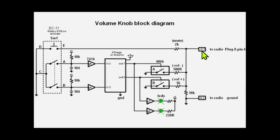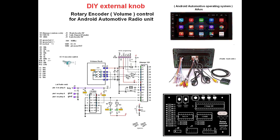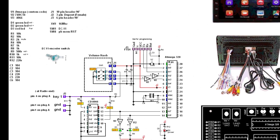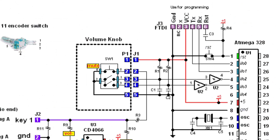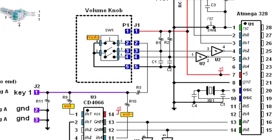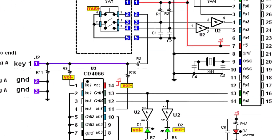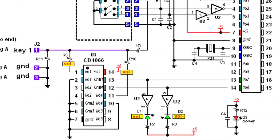The resistors would be the equivalent of the volume plus or minus on the steering wheel buttons. In the schematic diagram, switch 1 is wired to the buffer U2 and into U1 pins 2 and 3, then outputs 7 and 8 to the quad bilateral switch U3. U3's output controls two resistors R9 and R10, mimicking the buttons on the steering wheel volume functions.